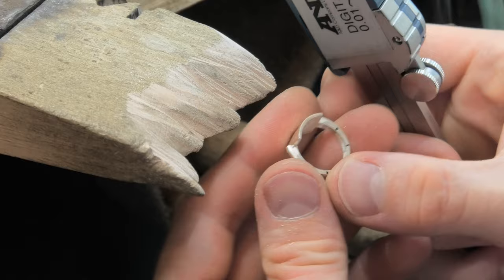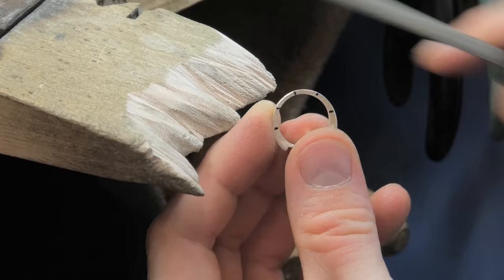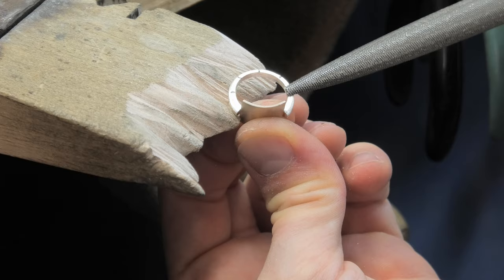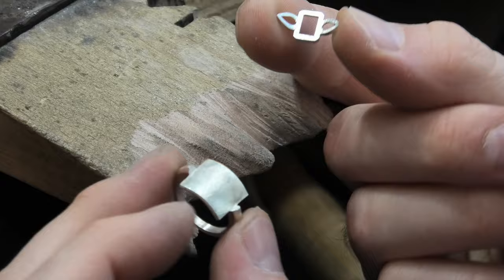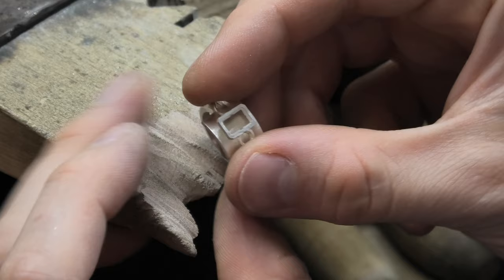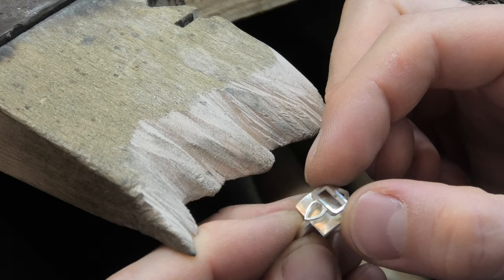To get measurements the same, I would put a very slight flat on there, then after your measurements are quite good you can round it off — but don't touch that middle section. By eye, just match it up — there's a flat on the side, make sure that looks nice and symmetrical all the way around. If you're doing one for a customer, get this all polished, papered and polished underneath before they go together — that's what makes the difference between your handmade high-quality piece and a crappy CAD-design 3D-printed job.